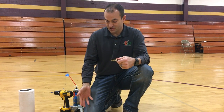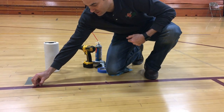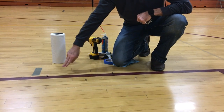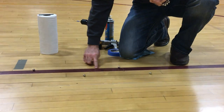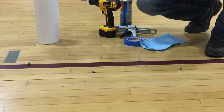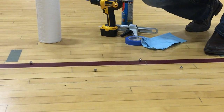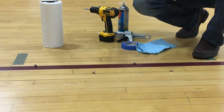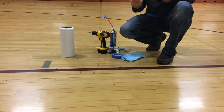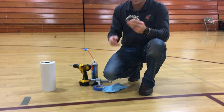In this particular gym, we're seeing that the nail pattern is random — there's not a specific nail schedule. We are seeing nails that are clearly further than 12 inches apart. That doesn't necessarily dictate 100% why you have dead spots, but what we're going to show you today is a couple of things you can try. So number one, if you can check your nail schedule, that would be great, but you'll need some magnets.